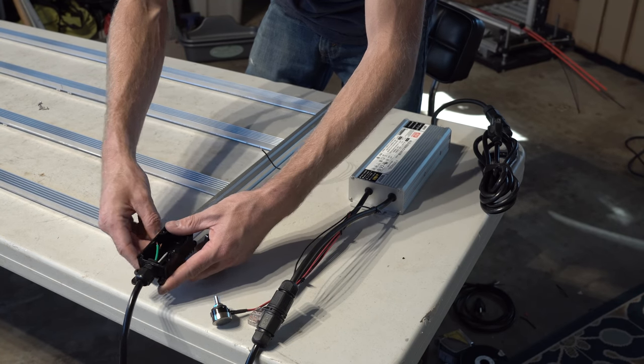They slide in right into the 8020, and then I cleaned it up with what we'll talk about, the frame finishers. But if you wanted to go a little more economical route, a simple quarter 20 threaded eye hook. Doesn't have to be super long like this, but this is just what I have. And I have just a nut and the T-nut washer. That'll slide right in the 8020, and you can either do four or two or whatever. For these, I have them just a little bit of play inside my thing. So based on where my cord is hanging and the balance, I can get her leveled straight. Has just a little bit of adjustment, probably can only move about a centimeter each way, but that's enough to give me my hanging adjustments.